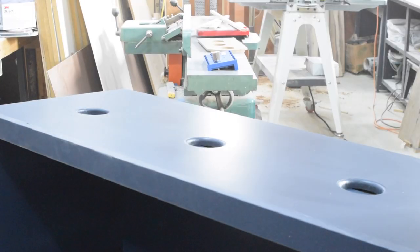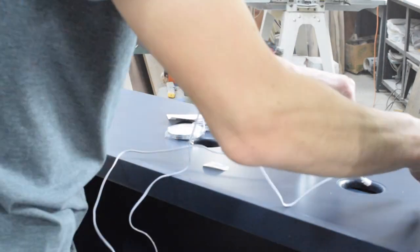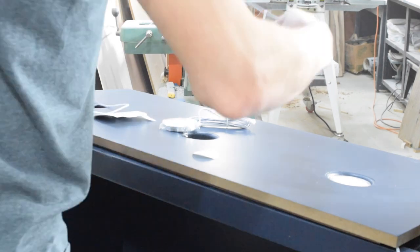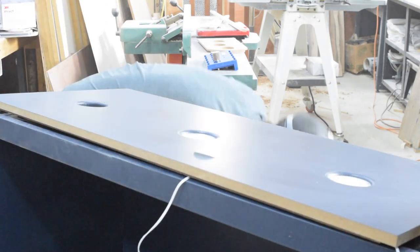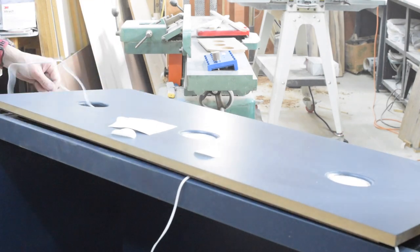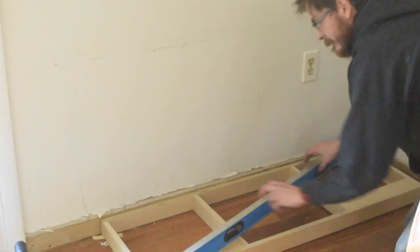After building up my crowns I'm going to pre-paint everything — everything's pre-painted, and I'll just have to cut the ends when I go to install things on site. Then you can see the puck lights fit phenomenally well in this recessed panel. I'm going to set those in there so that all I have to do is run the wires through the side of the cabinet, pop the panel in, screw it down from the top, and we're going to be ready for install.